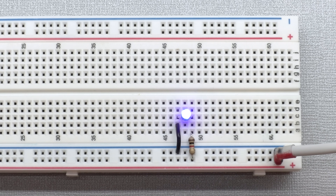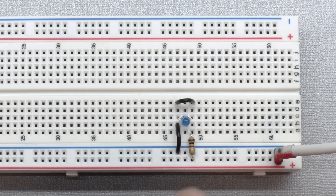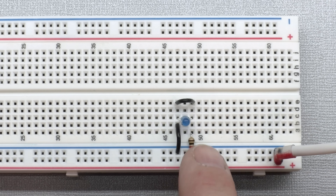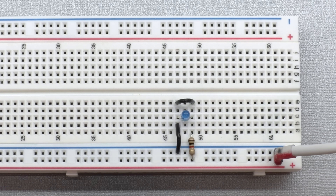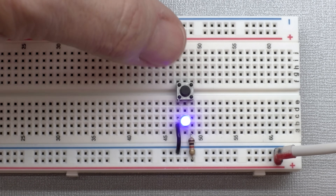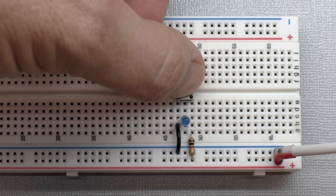Now I'm going to invert the circuit. What I did is effectively short out the circuit, but it's not a true short because we have a 1K load. At 5V, a 1K resistor shorted across the leads is fine. It gives the electricity a shorter path because the wire has much less resistance than the LED. I showed you with a wire to make the point, but now with a button: when you push the button, the light goes off. That's why it's an inverted circuit.